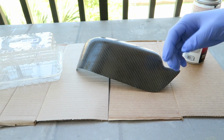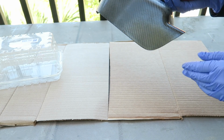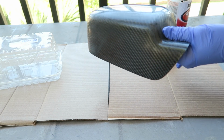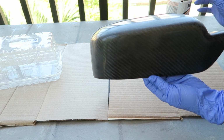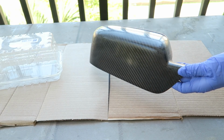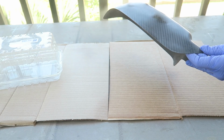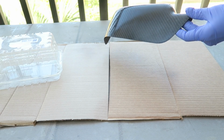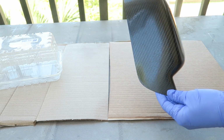So I tried something that was, in hindsight, not the best idea. I ended up spraying it quite thick, and while it was still fluid before it cured, spreading it into the pinholes, and while I was doing it, it looked a lot better. So this is the deceptive part of sealers that I have fallen prey to before. Before it dries, it seems like it's filling things in pretty well and that you're going to get this thick glossy finish over top that maybe just needs some sanding but can then be sanded and polished to look really nice. The thing is though, when the sealer dries, it shrinks and it's no longer filling things in nearly as well as it looked while it was still wet.